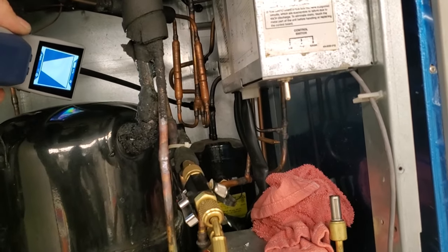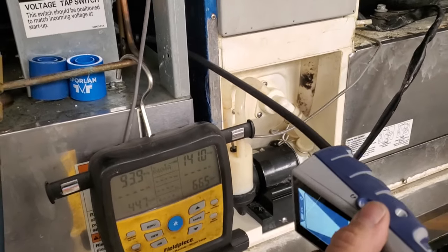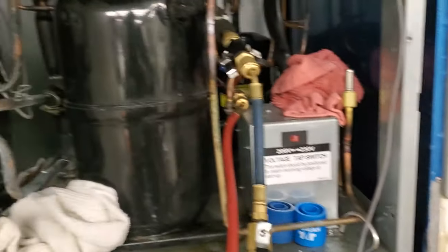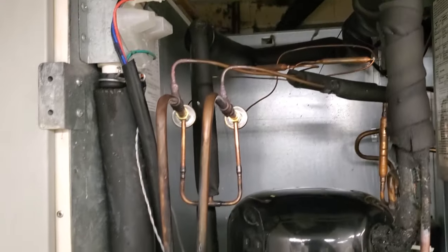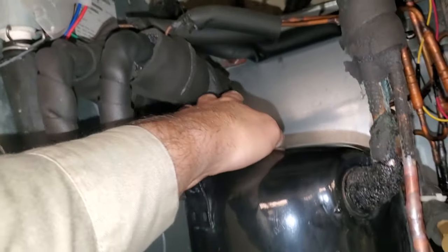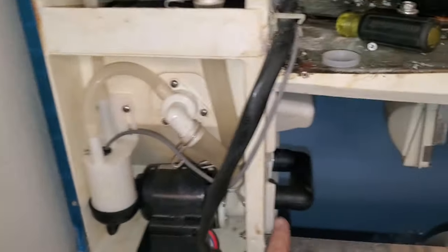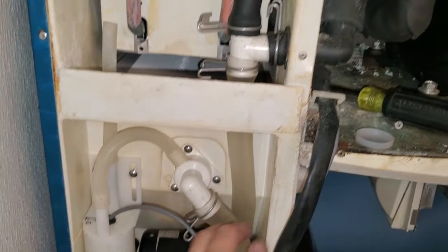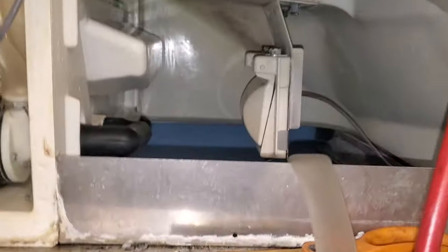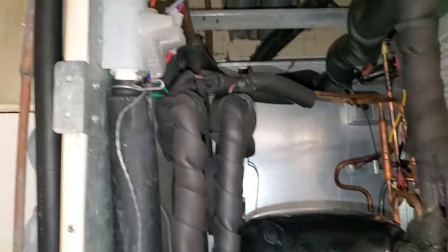We're looking good — back down in here on the dryer, nothing. We're going to go ahead and start taping everything up. It took the full nine pounds four ounces of the full charge. I did my best — it's not perfect. Insulated this stuff as good as possible, sensing bulbs, tried to use the old jacket. Everything's plugged back in. Went ahead and replaced these vinyl hoses and changed the cube guide. We're going to pull that mechanical bin switch out.